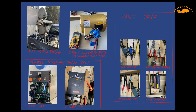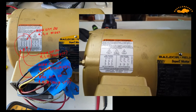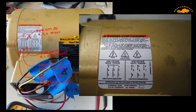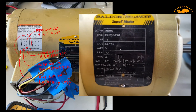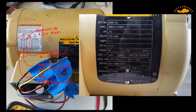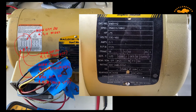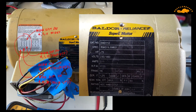To start, the first thing you'll need is a bandsaw, a three-phase induction motor — I recommend a half horsepower to one horsepower — and a variable frequency drive. I started with wiring the motor first, and you can see my notes in red on the left for how I connected the cord to the motor. I really had to use a YouTube video to learn how to wire this, and I'll leave a link in the description to the video I used.